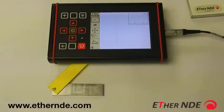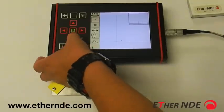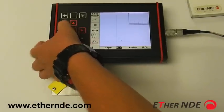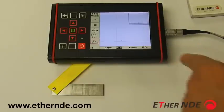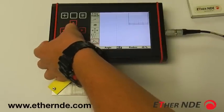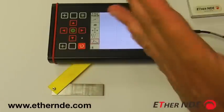The innovative feature we've added to the WellCheck to make it easier to use is the AutoPhase function. This effectively sets a threshold on the screen, which we can see quite clearly here, represented by the red circle. The operator can control the diameter at what phase the signal is set.